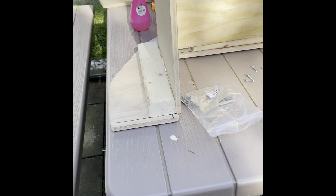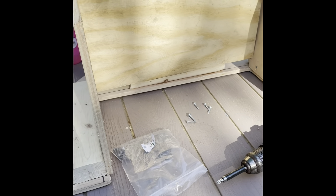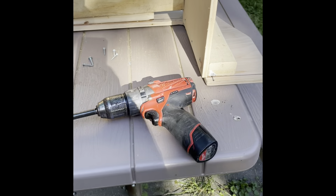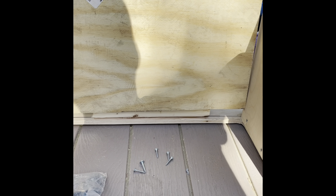Here's the start of the back box. I laid in two-by-fours as support — acting more like the legs of this box — cut at 12 inches, plus the half-inch top, so 12 and a half inches from the base to the top of the seat. Two-by-four supports on either side, a short two-by-four piece in the back. I cut side pieces to the length of the seat and they have an overhang that'll act as the seat-top support. I had an old sheet of half-inch ply for the inside of the box — just going to glue and screw it.